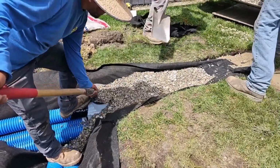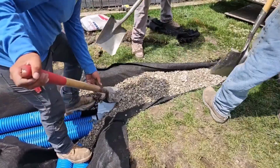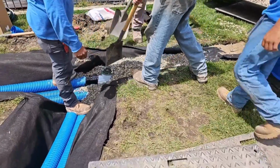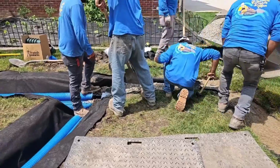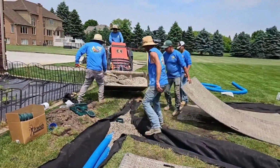1 in 3 French drains that we put in are to replace a failed French drain system. So we know what failure looks like. A single pipe French drain fails. You just don't have enough stone in the trench. You have 1 pipe, it's 4.5 inches wide, outside diameter, and then you have some stone. That's it. Very narrow. Usually they just make it with a 6-inch groove.